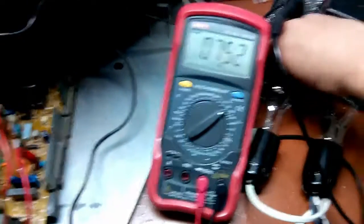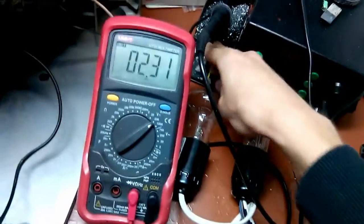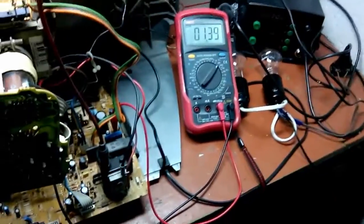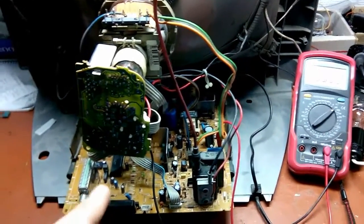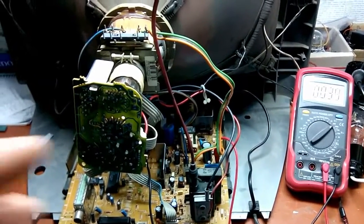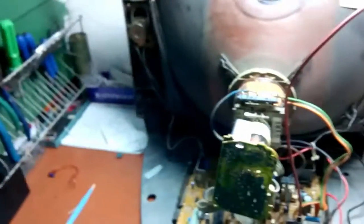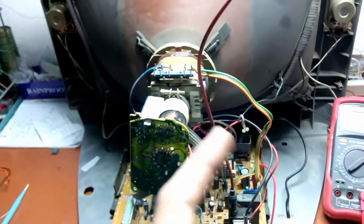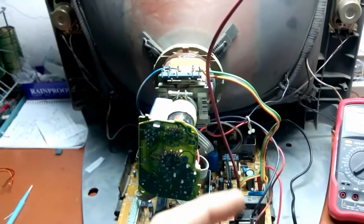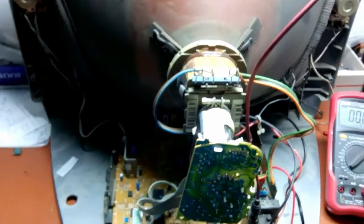Alright, I found a few more problems. When I was desoldering the KA7630 — which is not supposed to be there, don't do this unless you know what you're doing — I was mucking around and knocked off a few SMD resistors with the solder wick. After replacing them I didn't make a nice solder joint, so one transistor effectively had one leg not connected.